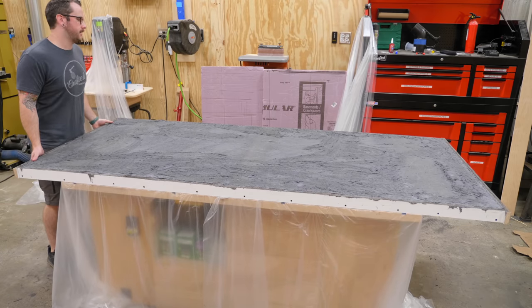For the legs on this table, I decided to go with these metal legs from Rockler, and I was really impressed with their quality. I obviously could have welded these myself, but I was in a bit of a time crunch, and I think these are a great option if you're not set up to weld your own legs. I also decided to add an apron on the long edges of the table, just to help support that long six-foot span between the legs, using some two-inch angle iron. To end up with the most strength, I decided to overlap the angle iron onto the mounting plate for the legs so I could attach the aprons both to the top and to the legs themselves. I got the legs positioned where the top was at full thickness and marked out the mounting holes on the table so I could drill them out later, then set the angle iron pieces in place to mark where I needed drill holes.